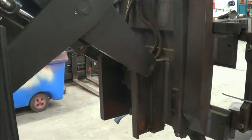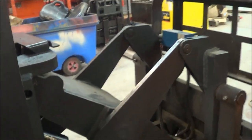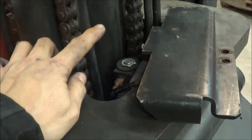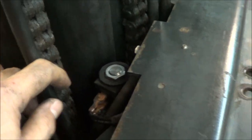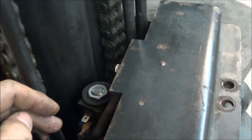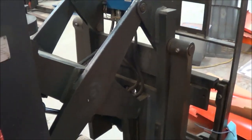The question now is: is this an electrical issue, an electromechanical issue, or just a mechanical or hydraulic issue? The best way we can determine that is to eliminate the electrical possibility. If it is an electrical issue, we're going to try to take out the supply to that reach solenoid.